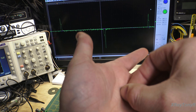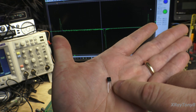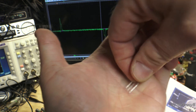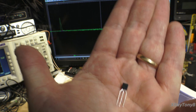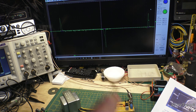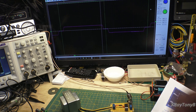So those transistors look like this, and you can see they have very short, thin legs on them, and they don't really have any kind of manufacturer's mark on them or anything. And if we look at this one, for instance, it has thicker, nicer leads on it and better formed casing, and it has the little symbol of Fairchild Electronics. I don't know if you could see it, but it's a Fairchild. It's a real one that was ordered from a domestic supplier. I think this one may have come from Mouser or DigiKey or somebody. So let's take one of these transistors out and put this one in its place.